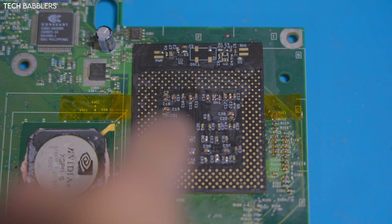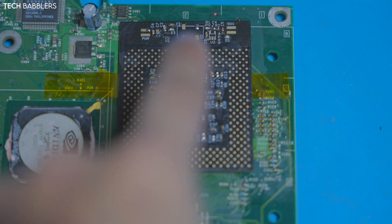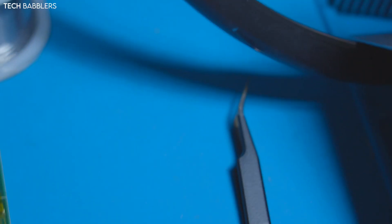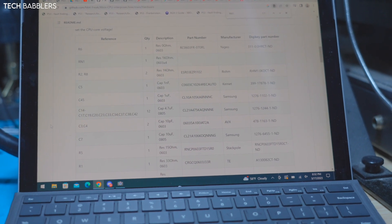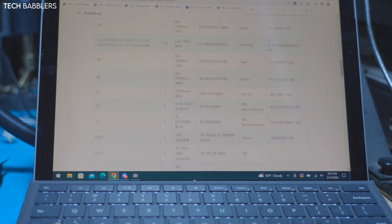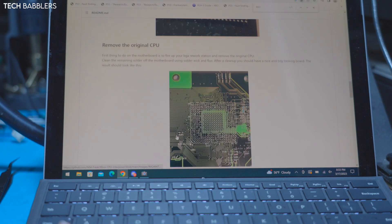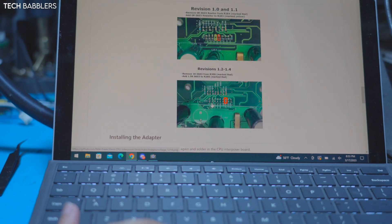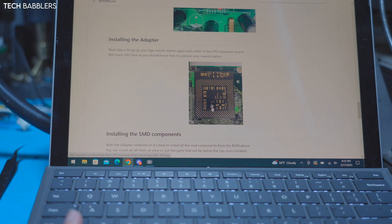I didn't shoot any of it, but I had to place down each one of these resistors and capacitors. I'm missing an oscillator, a voltage regulator, and three more 1k resistors. I'll leave a link to all of it — essentially this is N64's GitHub and there's a lot. I have a whole bag of different stuff you basically have to solder to each point. This is how the bottom side looked when I cleaned the motherboard. I also had to do a voltage change — I'm on a revision 1.2 to 1.4, so I had to remove the 1k and replace it with a 1.5k, and I installed the adapter.